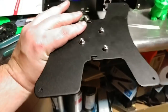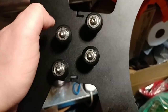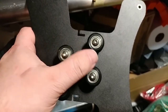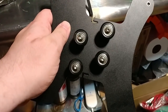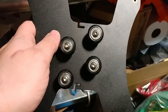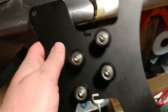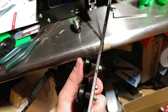Another problem: one of my posts was crooked, causing the entire bed to want to torque. I also don't like the rhombus wheel setup. With an equilateral triangle arrangement, over-tightening one side will torque the whole bed, pulling one wheel away from the rail and pushing another into it. My gut tells me to line up the two side wheels directly across from each other, so over-tightening simply pushes harder without torquing the bed. That torquing is likely what bent the wheel and made leveling unreliable. Otherwise, nice thick plate.